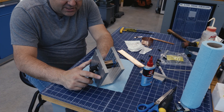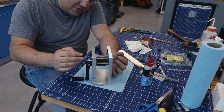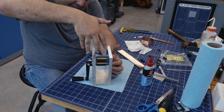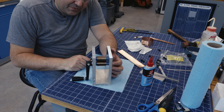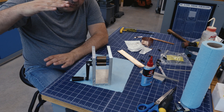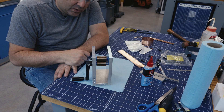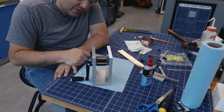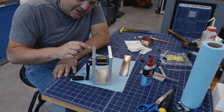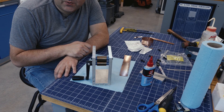Now we need to do a couple of things. My first thought is I want to redesign the mechanism that holds this so that when we tighten it, this can still spin freely. And I also think we need downward pressure — I was going to lock it in place but I'm now thinking that won't work. So I'm thinking I should have some big springs pushing down on this roller, maybe with a screw so we can adjust the pressure the springs are putting on to get the right divot that we want. So I think that means some more machining — we'll make this part one of the video. Thanks for joining us and we'll see you in the next one.